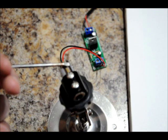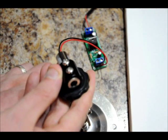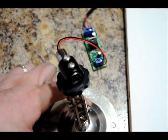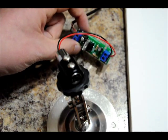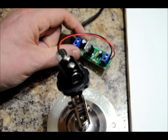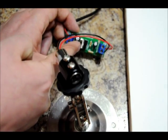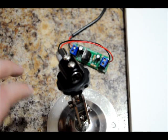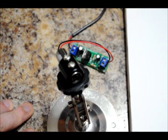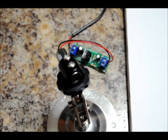It's a perfectly legal laser to ship and import. We've also got some rewards with an adjustable stand that allows you to adjust several axes to easily aim your laser at one of the four receivers on the processor board. In addition to that, we've also got a 3V regulator board that takes between 4 and 15V DC — any voltage in between — and converts it to a safe 3V for the laser. It's also got an on-off switch right here. I've got this unit plugged into the wall via a 120 to 240V AC down to 9V DC at 1 amp. However, this laser only requires about 25mA at any given point. What's neat about the laser is you can actually focus it by twisting the top gently. We'll get to the laser a little bit later.